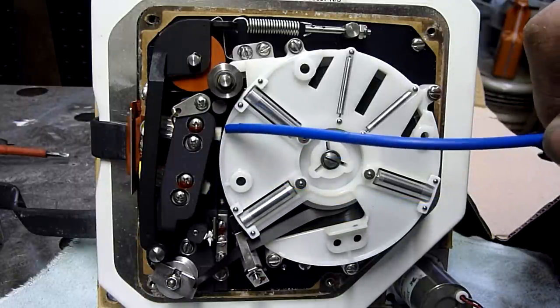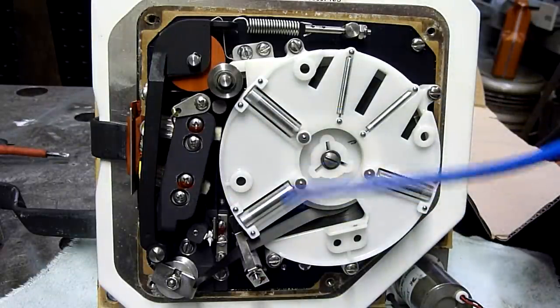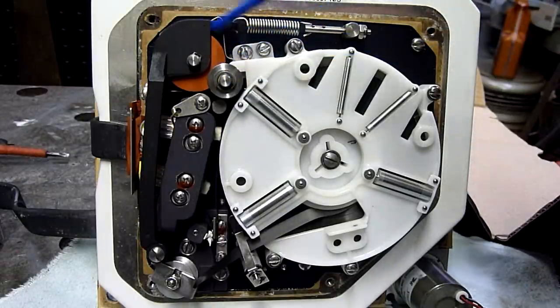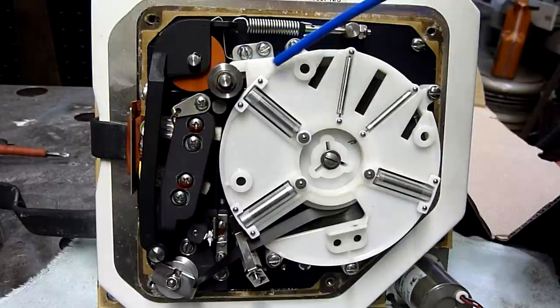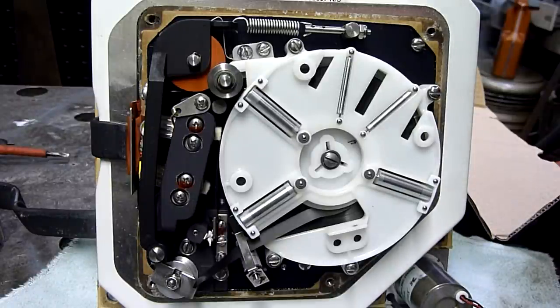There's two felt wipers here pushing the tape onto these two heads which have numerous connections - way more than a normal audio tape. A normal audio tape has about four. There's a guide post there. That's the main capstan drive and a pinch roller - just like in a normal tape player or VHS player. The big flywheel on the back is the capstan flywheel. The tape feeds back into the spool - it's as simple as that, just circulating continuously. It's just a continuous loop with no rewind.